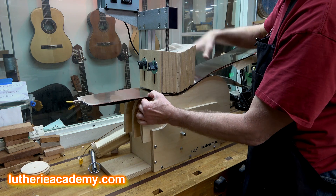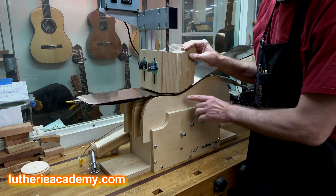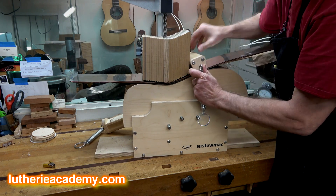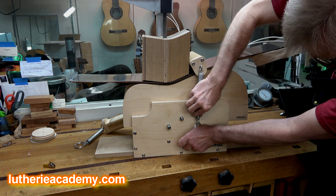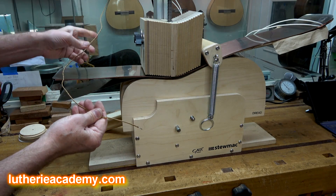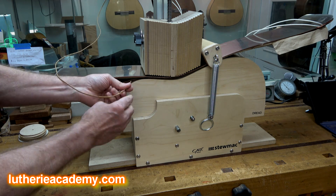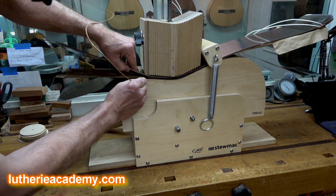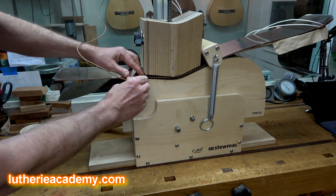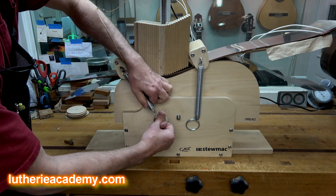By the way, I'm bending these sides at about 2.3 millimeters — you guys working in inches, go ahead and convert that. Show it just a little bit of loving at the waist to lock it into position. I've already plugged in my heating blanket. Now I'm going to pull this waist clamp over and carefully place it on — that's what's going to bend the lower bout. There's one for the upper bout as well. The bender comes with a thermocouple and onboard electronics to control your temperature. I place the thermocouple on top of the wood and under the blanket — not under the form, because if you press too hard, you can dent the wood.